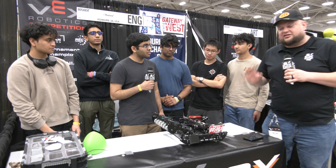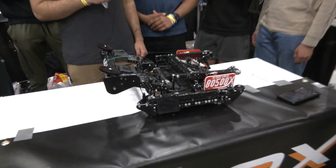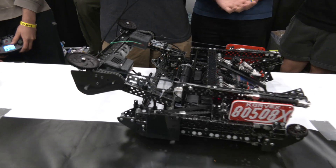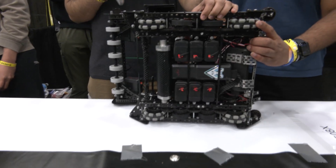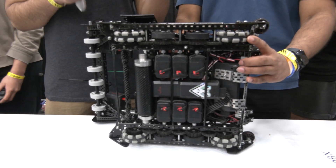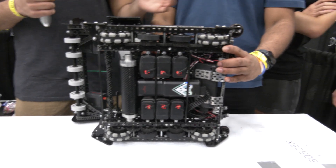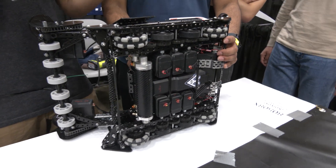Taren, let's talk about your chassis and some of the general design that goes into it. I'd really like to hear about your journey into VEX and how all this came together. So we can first talk about our chassis — it's one of the most important parts of our robot. Something interesting we've done is we've tried to go for a really fast drivetrain. In the past we've run drivetrains like 450 with 3.25, 360, but this time we went for 600 with 2.75.